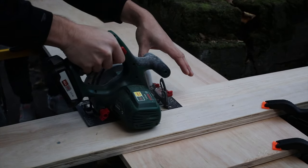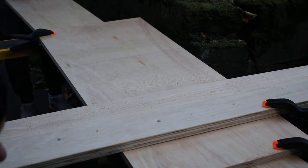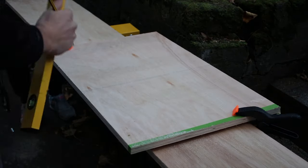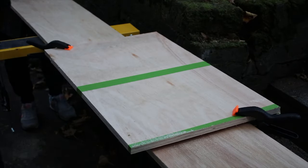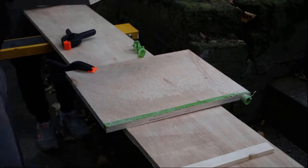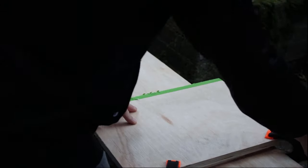This is a very simple jig that I made myself. All I needed is two pieces of leftover plywood with the original edge that is straight. Then I screwed them together, simple as that. You can also avoid chipping or tear-outs by using a different blade that has more teeth, known as a plywood cutting blade. Since I didn't have this blade I still had some chipping, but much less using a tape.